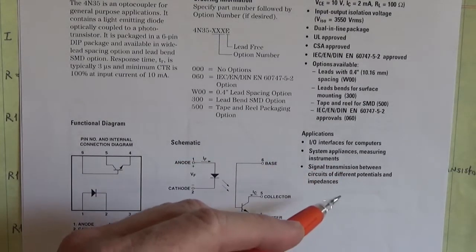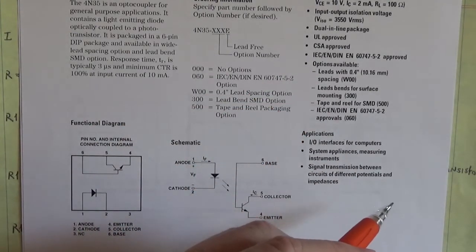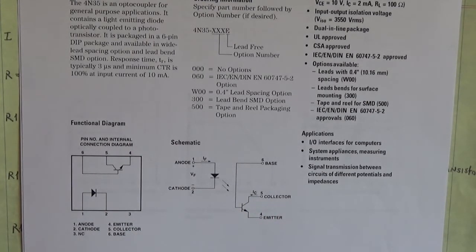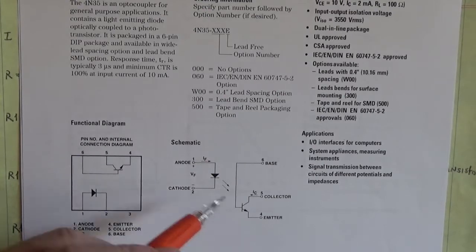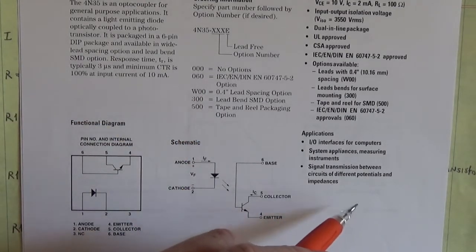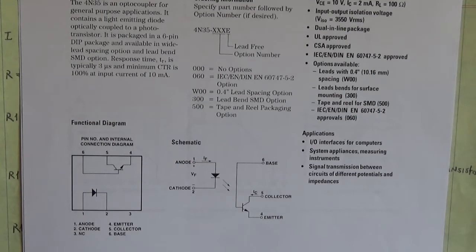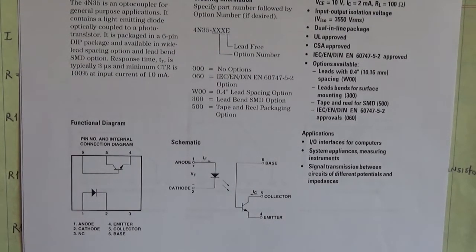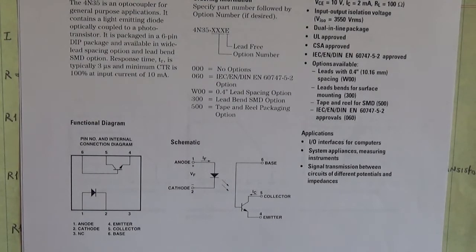Now why is that important? Well, we've seen in the past where IGBTs explode. They destroy themselves and that high voltage energy shoots back up through the gate of that insulated gate bipolar transistor power module and destroys everything connected to it. You don't want to lose control of that circuitry when the IGBT explodes. Without this isolation, that high voltage energy would shoot back up and destroy the control — and if your control is destroyed, there's no telling what else could happen or go haywire.